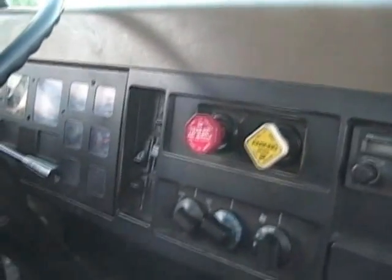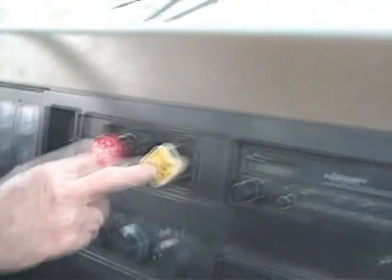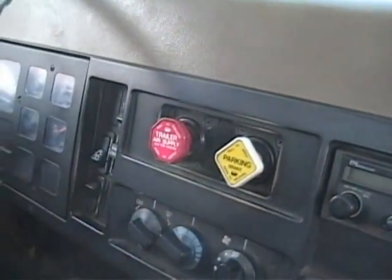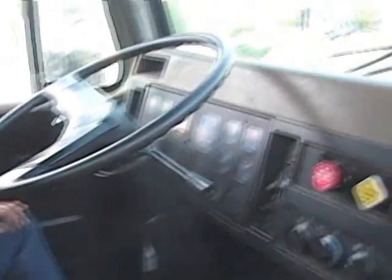Okay, I'm going to put the tranny in the lowest gear, shut my engine off, release my clutch now. It's important. I'm going to release the tractor and the trailer brake. I'm going to push both plungers in. So the only thing that's stopping us from rolling is the fact it's in the lowest gear. Okay, now we're going to wait for our needles to stabilize.